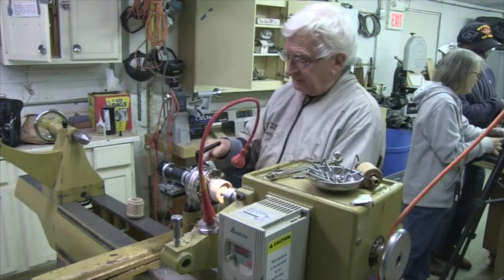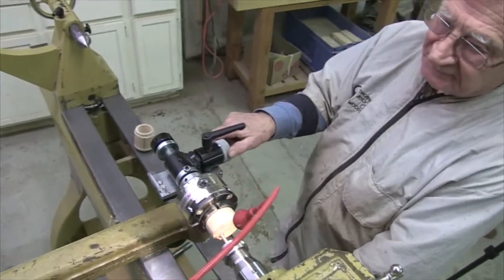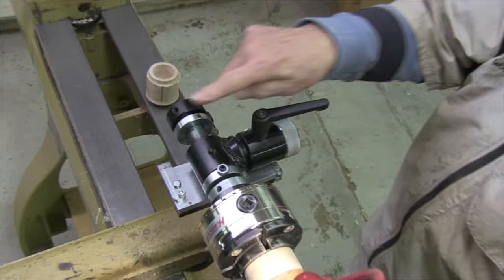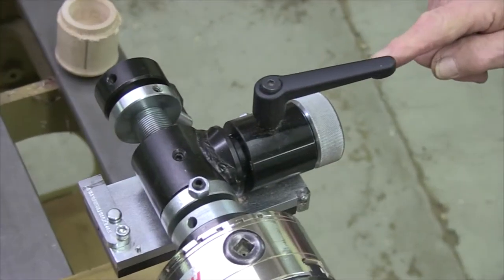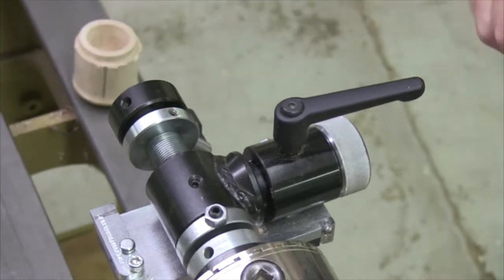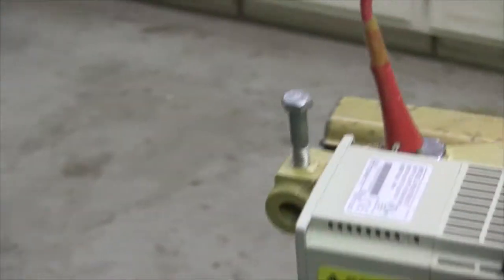This mechanism has a click mechanism in the back that you advance on this axis back and forth, and that is your depth of cut of your thread. He has devised a system where you have 5 clicks for 16 thread per inch threading.